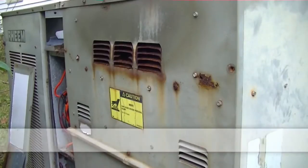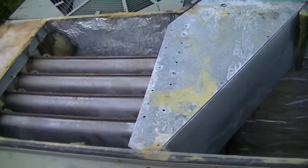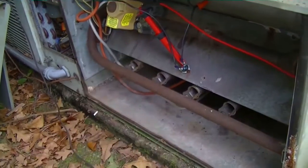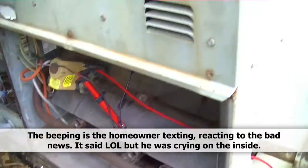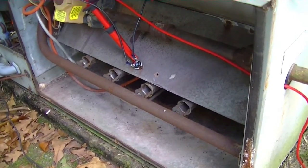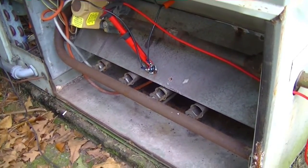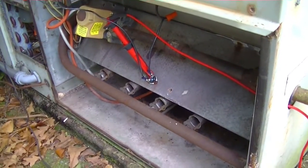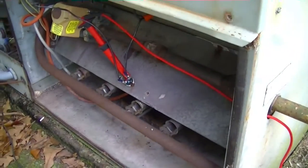The RRGG is all apart. What I found was when I looked inside the end of the unit and up into the burners, I saw a very suspicious piece of rust. I then took the top off the unit and looked inside — I could see light coming through the other side, so the heat exchanger is definitely cracked. When the blower came on, I did feel the whoosh coming back on this burner from that heat exchanger, because this blower blows directly into the end of that heat exchanger where it's cracked. Bad news for this old boy.